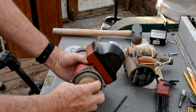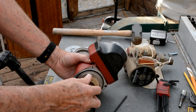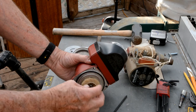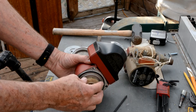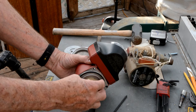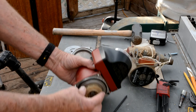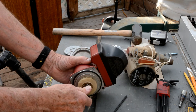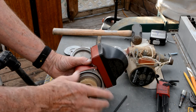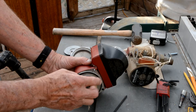It was frozen up — I put a little oil on it. But if it continually sticks — like it'll stick if this is in a boiler system and you turn the boiler off for the whole summer and then go to turn it on again in winter — it might be stuck and you might just have to pull the pump off and spin the impeller to free it up. If it gets stuck too many times, it's time to change the cartridge.